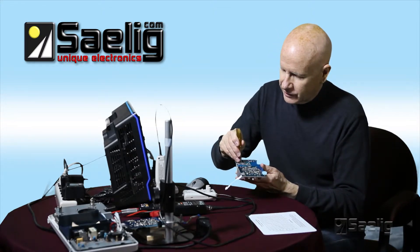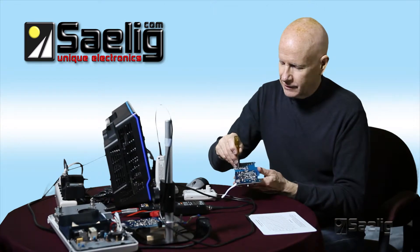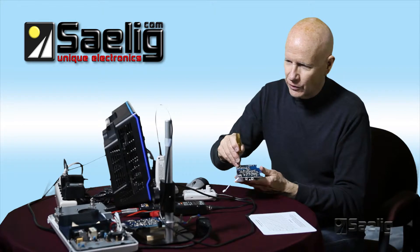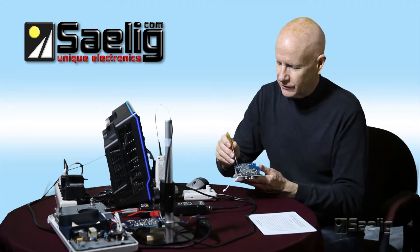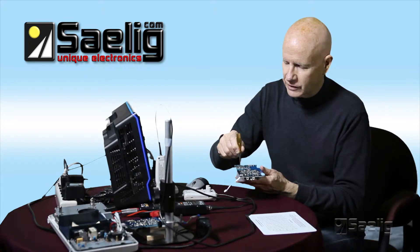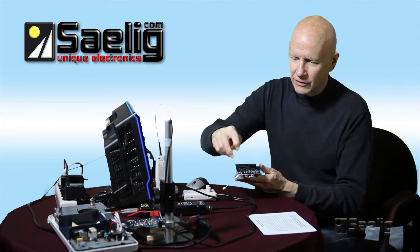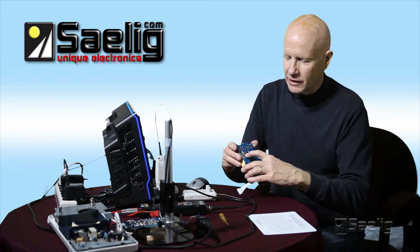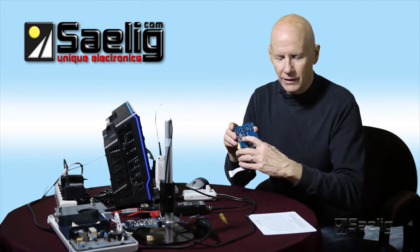and placing it perpendicular to the long dimension of the trace that you want to measure the current on. You also position it — either by touching or you can hold it in a positioner like the one I've got over here. It's somewhat important to make sure that the iProbe tip is held normal to the surface of the circuit board. Now here's what you have to do to get it set up: the first thing is you have to use a millimeter scale to measure the track width on the board.